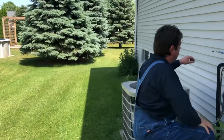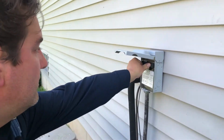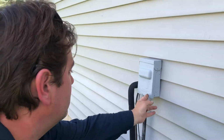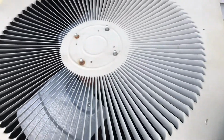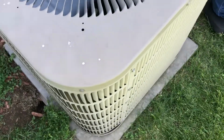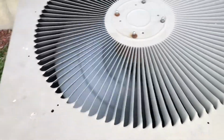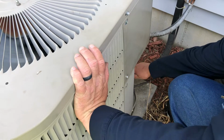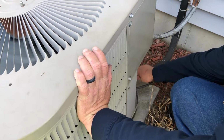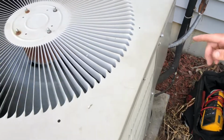All right, here we go. We're gonna plug it up. Shut the lid. Now, it's gotta think about it. Oh my gosh. So did you hear that? The compressor kicked on, and then the fan kicked on. Watch your fingers now. High side hot, low side cold. Starting to get cold. The reaction is taking place. It's gonna take a while to cool this hog. It's hotter than frick outside, but we did a successful air conditioning repair, right?